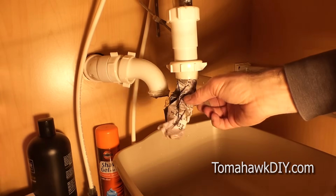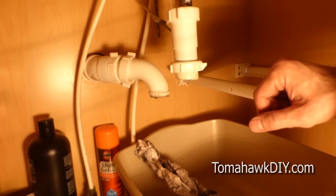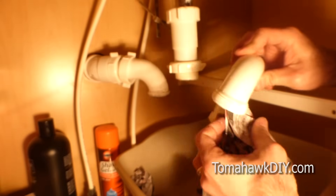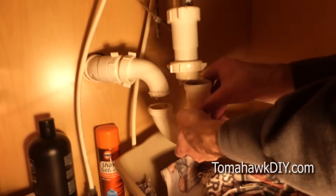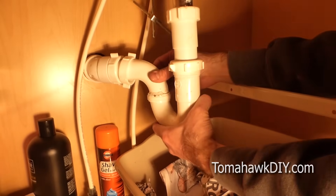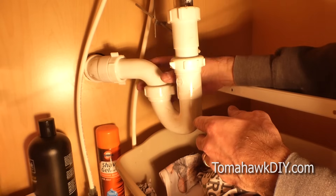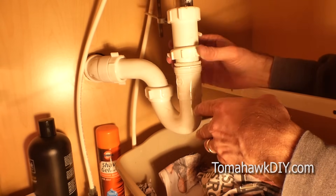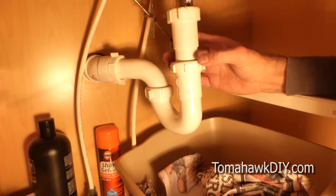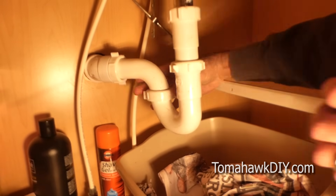Let's see what happened down below. Now that we've chased all this junk out, we're ready to work on putting the sink back together. Check out the inside of here, see if there's anything you need to clean out — in this case there is. We got this thing cleaned out, so now we're going to reconnect it. Slide it up — you see there are these gaskets that are going to get nice and tight right around the edge. I like to tighten a little bit down on one side, then come over to the other side and start tightening. Work your way between the two rings on the P-trap as you tighten them down, and that will help the gasket sit nice and smooth.